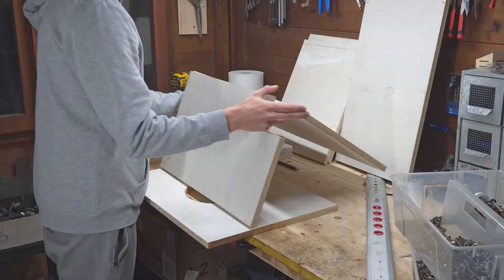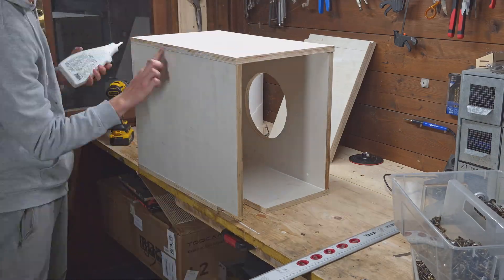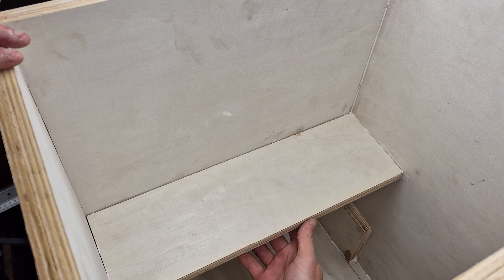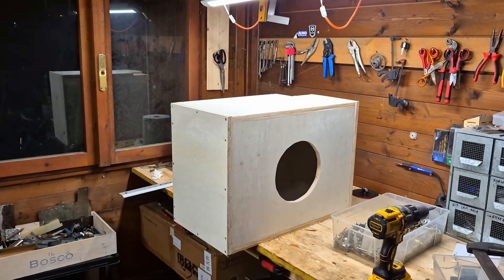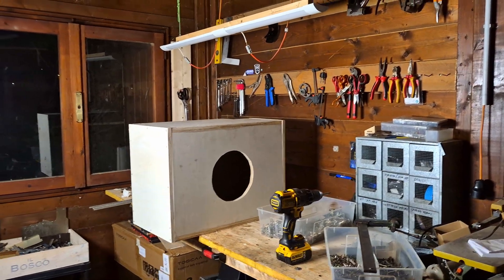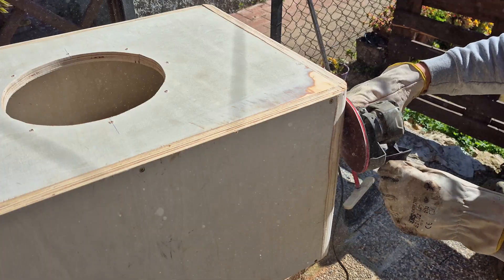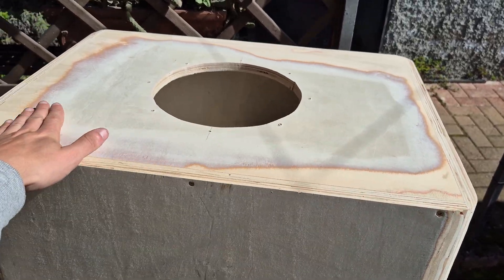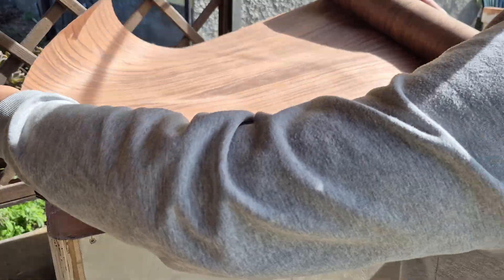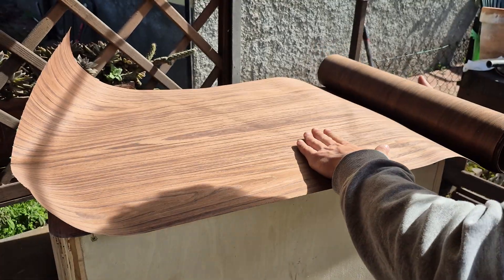Due to the huge size, I made the design as simple as possible — just a simple box that can be easily constructed by cutting the various rectangular panels using a circular saw. With the panels cut, I proceeded with gluing them together using a bunch of screws to clamp the pieces together, also ensuring straightness. Before moving on to sanding, I also added a central brace to maximize rigidity, once again due to the big size of the box. With the box assembled, I rounded the corners and smoothed out the radius with an angle grinder, then finished the look by adding some oak wood veneer, making its look really pop and matching the aesthetic of the speaker very nicely.